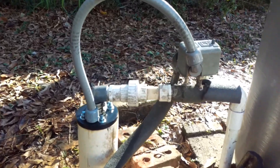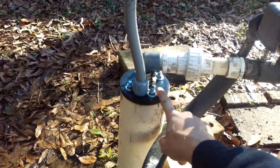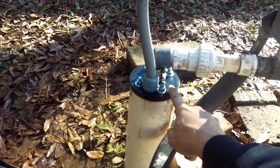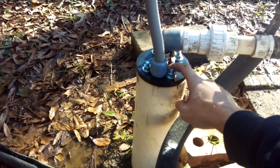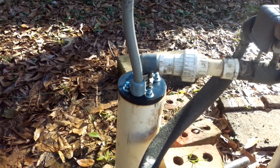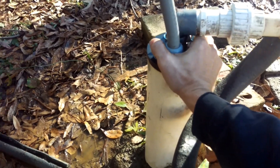You want to make sure that you seal everything up — either replacing the old well seal or installing a new one, especially if the bolts are rusty and won't tighten. Because the next time it rains, you may have leaves, fungus, or bird droppings — no telling what — run right down into the well. That's re-contamination. So you've got to make sure that this is sealed.